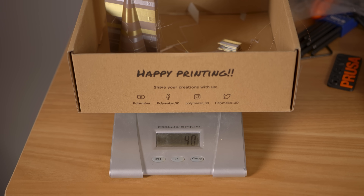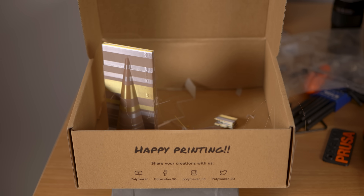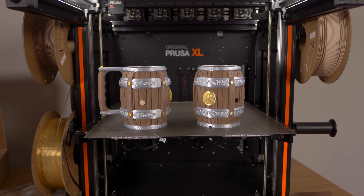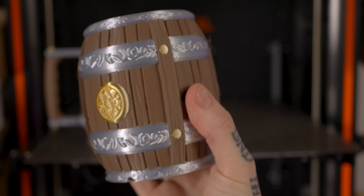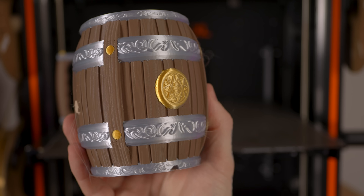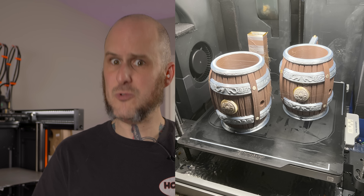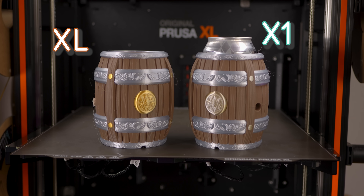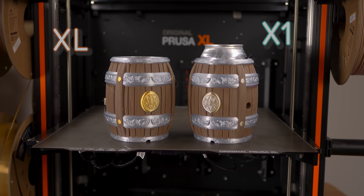That said, it's going to take a whole lot of prints to add up to the price difference between the two machines in filament cost alone. You might have noticed the prints from the XL were a bit hairy — there's definitely some wispy stringiness between going from the model to the purge tower and the tool changing. But it's not big boogers that have ruined the print quality. I'm actually really impressed with the print quality. And if you look at the X1 prints, those had hairiness too. These are literally the exact same spools of filament, so maybe they need to be dried — either way they need to be tuned in better on the XL.